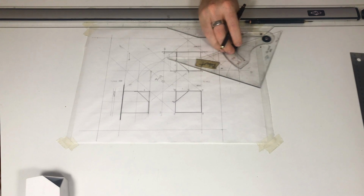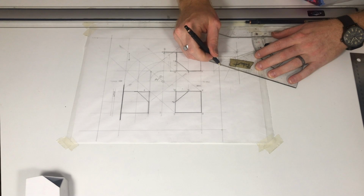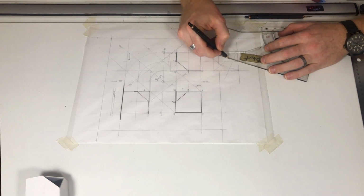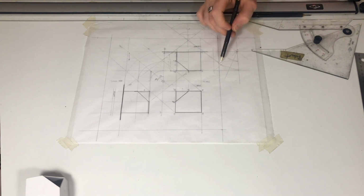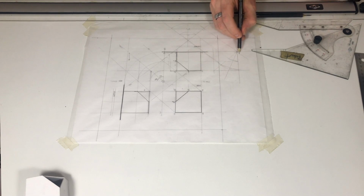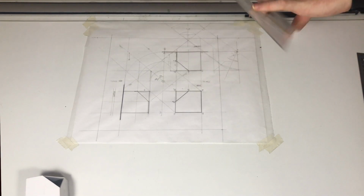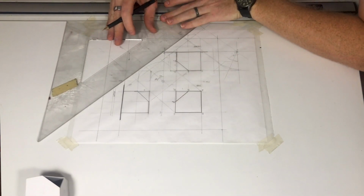There we go. Right, the triangle should always have all kinds of relative angles, so you don't have to do too much manual measuring. But I can transfer these to a straight line method as well. And maybe you find this to be faster. That's okay. It just gives a different look to the drawings. But these are equivalent, the arc or the straight line, as long as it goes perpendicular through the bisector of whatever this angle is. So now I've come around to here, and I can head off back up in this direction.